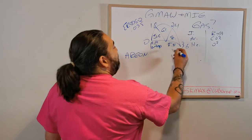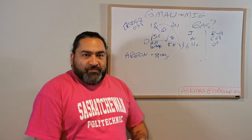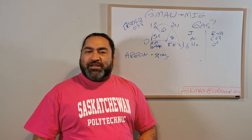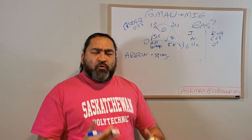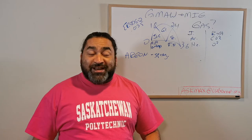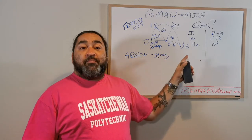So, for example, if I'm in a really high heat, so in the spray zone, high voltage, high wire speed, is argon good or bad? Well, at this level of heat and input, it's great. I actually want as much argon as I can get in the high heat area. Why? Well, the more heat, the more voltage, the more current, the more atmosphere draw is going to occur, the more deposition rate, the more issues can occur, the more contamination can happen. So I need the most amount of bouncers to show up at that party. Here is a 3,000 person clubhouse, and I need a lot of bouncers.